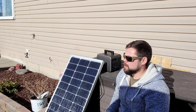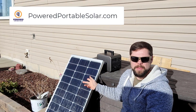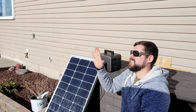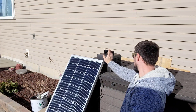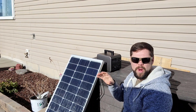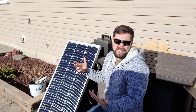I would say this is probably the biggest problem with the Vinic 500 — I can't see how much is going in. I can see that I'm getting a charge on my 100-watt solar panel, which I got from poweredportablesolar.com. I have a perfectly clear, sunny day with no clouds and the sun at its highest peak of the day, and I can see I'm getting a charge. It's at 5% right now, but it doesn't tell me how fast it's charging. To know the charging rate, I would need to get a watt meter. I think that's kind of a design flaw.